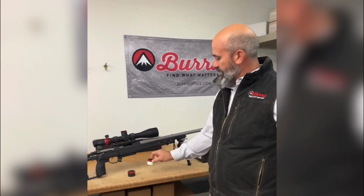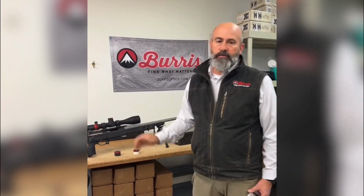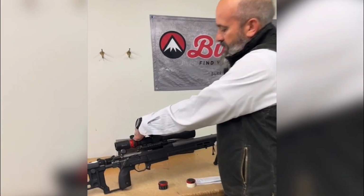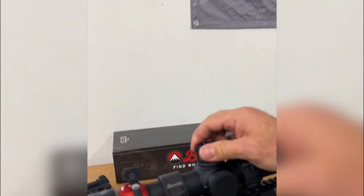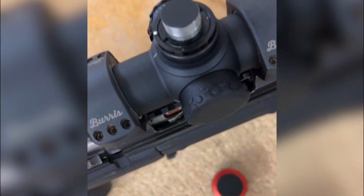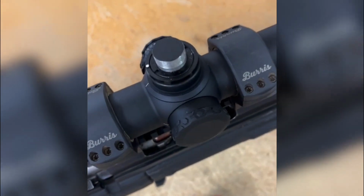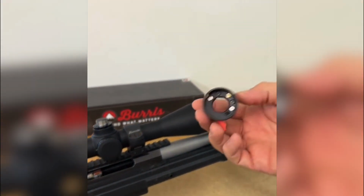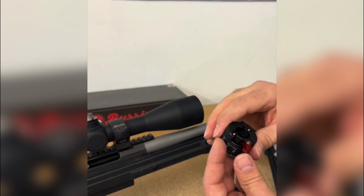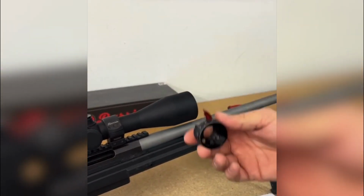So very cool feature. Underneath that, one of the really nice features is we went to a toolless ReZero. This function has this red cam bar. You loosen the cam bar up, and it lifts off. Very clean. This inner knob, for whatever reason, if you lost one of your exposed dials or forgot to put it on, has your mil markings to 12 mils on it as well. Very clean with this. Very nice tight cam lever. Don't need any tools to run this thing.